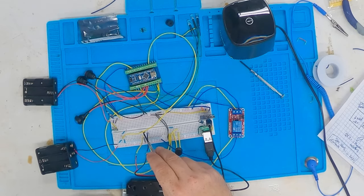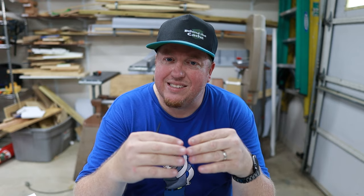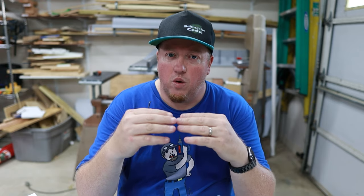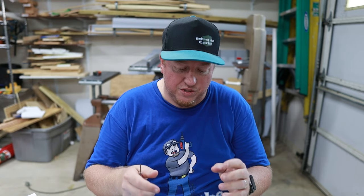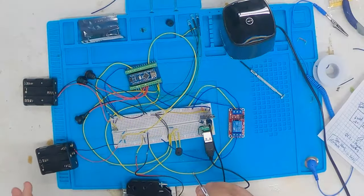There's a diode here between the latch connections. If you remember when we talked about diodes before, a diode is like a one-way door - energy will flow in one direction but won't allow flow in the opposite direction, whereas a resistor lets current go either way. This is a pretty large diode because of the amount of energy that's going to be coming through.